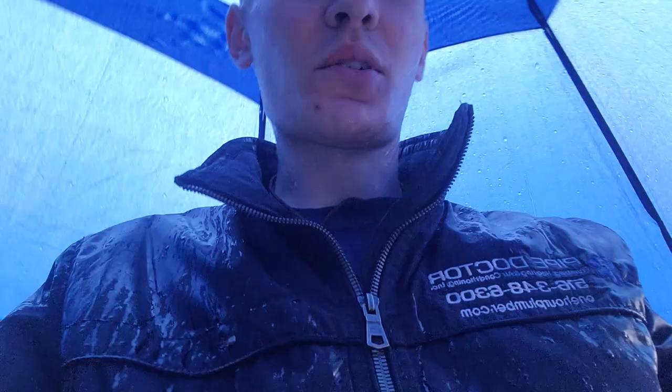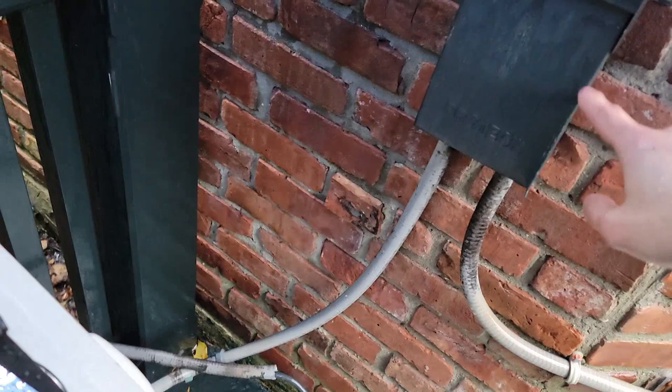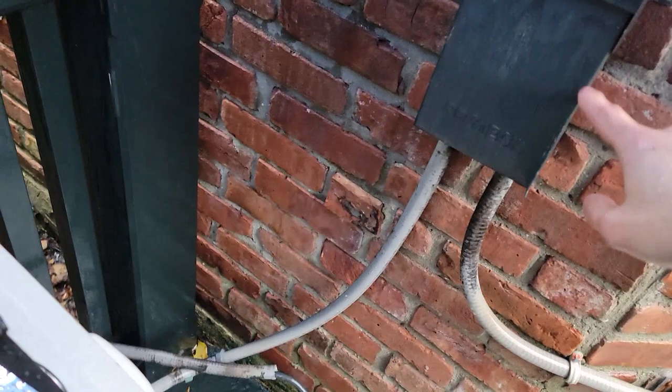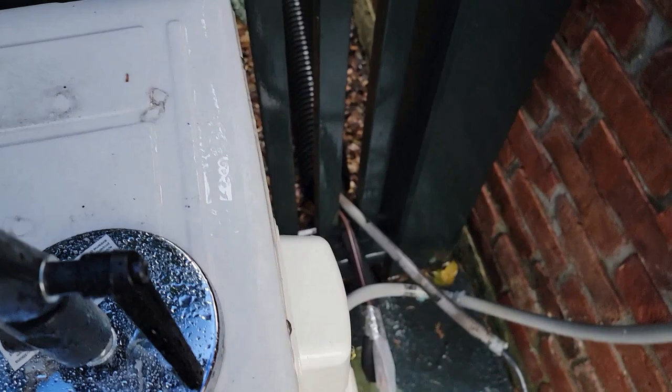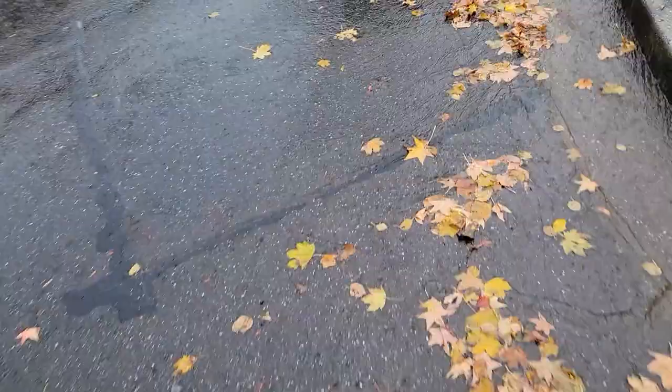It's pouring rain. I didn't get to record much, but I had the Trade Fox umbrella to keep everything dry. All I did was I disconnected the lines and I crimped them so moisture and dirt don't get inside. I also taped it up and put a bag over it, as well as disconnected the electrical. The disconnect is in the off position so it's not live. All they're going to be doing is moving this line set around to do work on a window that the line set sits in front of. You can see it's raining pretty hard — there's Peter. We're just packing everything up and getting it into the truck.